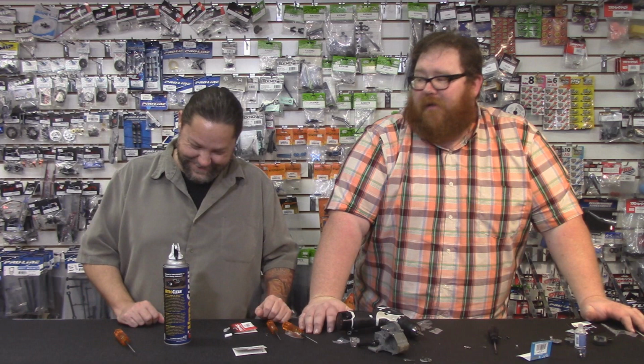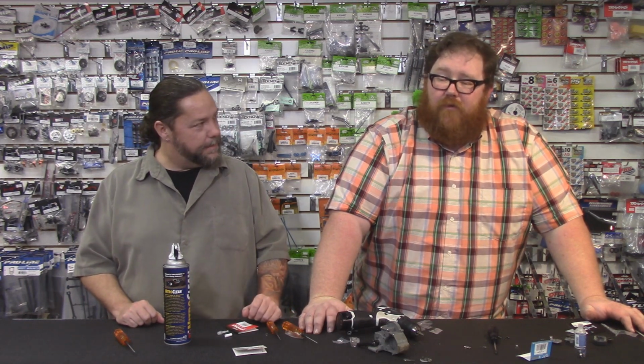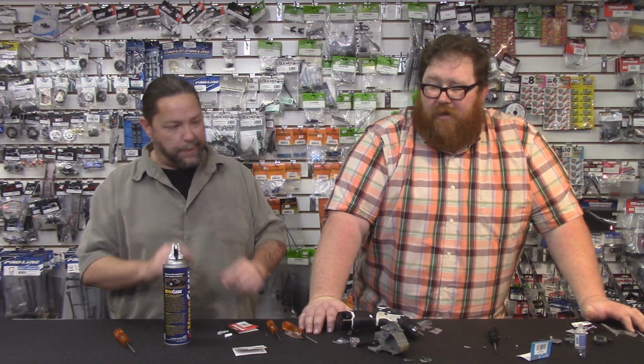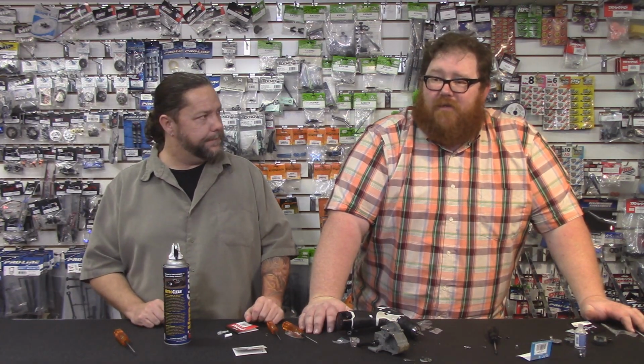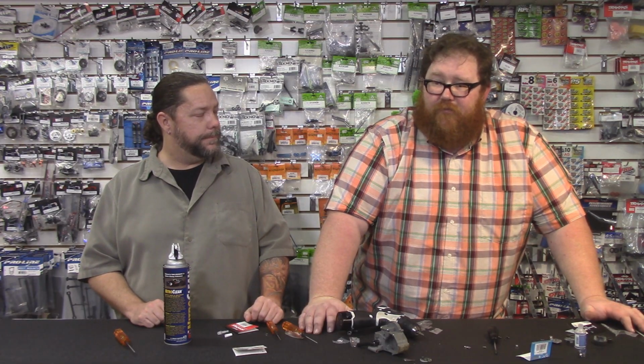What I would do in retrospect now is assemble it first and see how it all goes together, before you put fluid in there, because fluid makes it impossible to find everything. Because then you can't see the holes. So do a dry run, assemble it, and then once you're done, pull the top off, fill it with silicone fluid, then screw it together, and then you'll be okay.